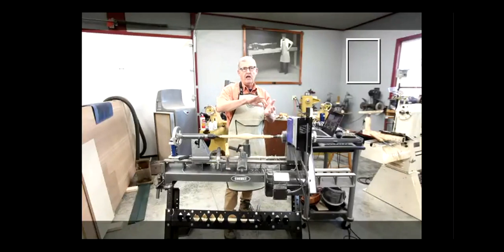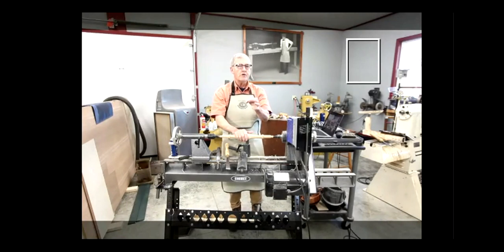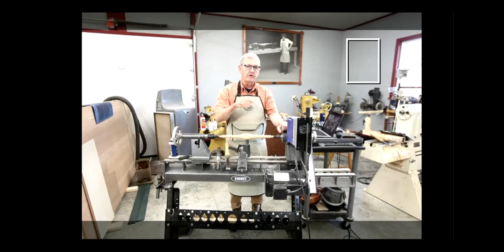You will be turning like there's 10 newel posts in a stair railing in our bedroom at the house that I turned in 2000, 2001, something like that. And I was turning one of these big baluster beads on the top of it that supposedly lawn balls were copied from. But at any rate, big catch with a spindle gouge right in the top, big hole there. I took about a 3/4-inch bit brace. It just drilled right down the center of that defect, drilled it right out of there.